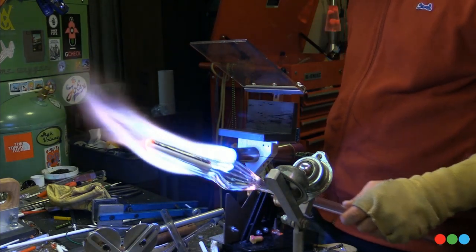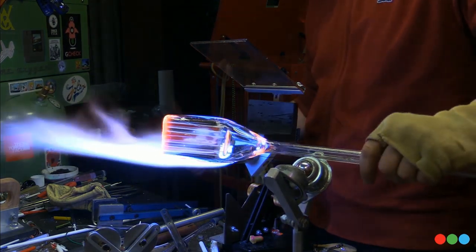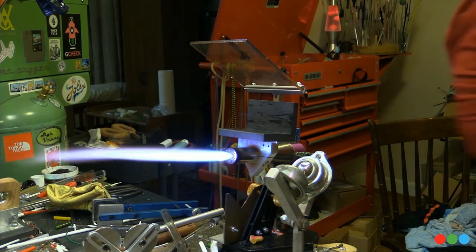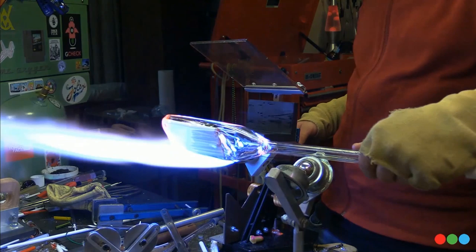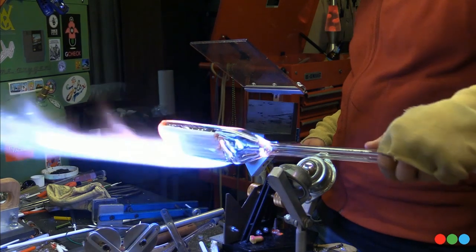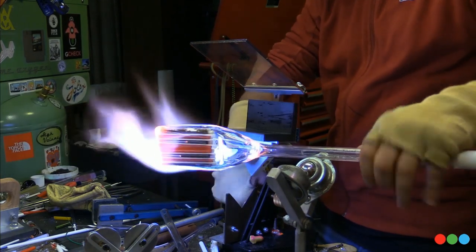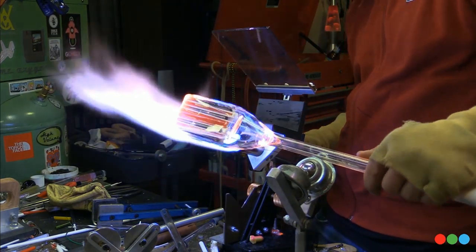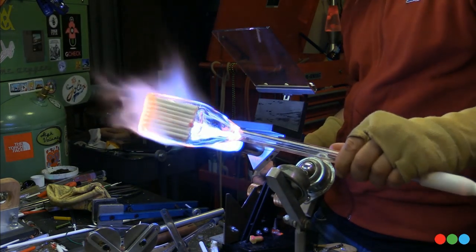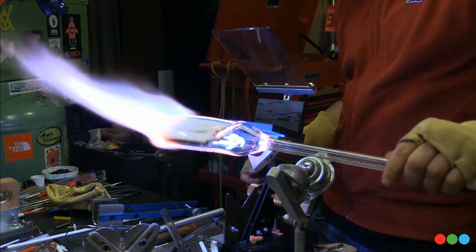Yeah, so those are the ways to deal with that. If you do the traditional method, where you use like an arbor press, Dustin Revere's got a great video where he uses the graphite-lined arbor press. If you're just mashing a bunch of rods and there's no clear involved, that's good for chip stacking right out the gate. But if you get good at doing that quick wipe, it's really not hard to remove that clear off the sides. And then you do end up with a nice coating of clear on the front and the back, which can actually be helpful, especially if you've got dichro in there. It gives you a little bit more protection. So you gain some advantages.